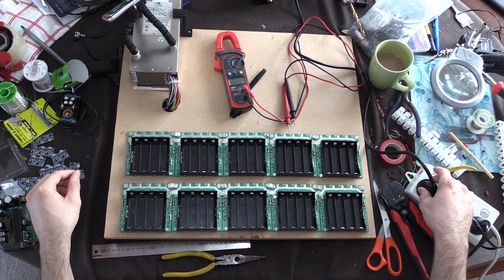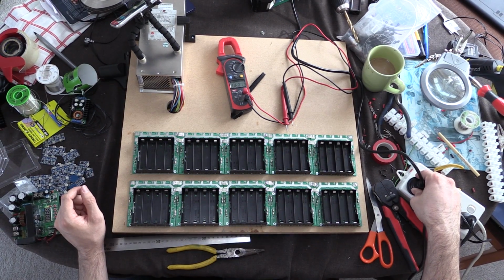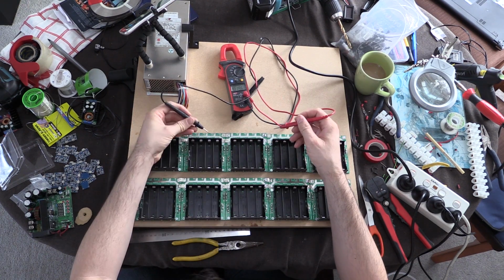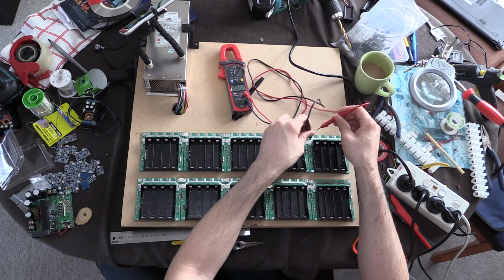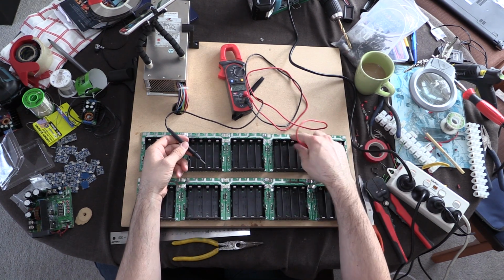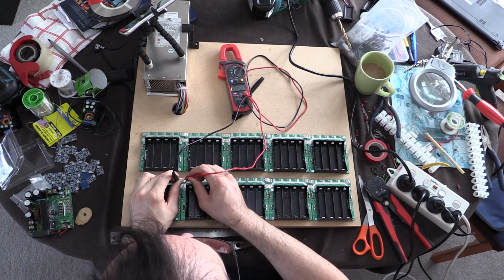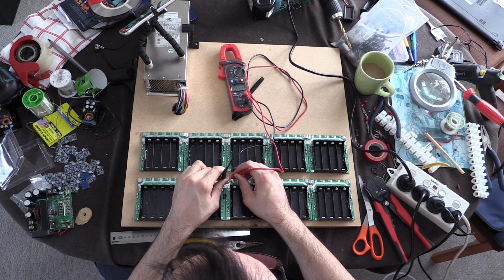So I've just connected this on, moment of truth, because that way the camera's on if anything blows up. So let's turn that on. Okay, so far so good. Bit of hum. Okay, so now we'll test out our 5.2. Come over to here. That's nothing. That's good, because this is going to be connected to our buck converter. So these 8 cells aren't connected to the main power supply right now. So 5.2. 5.27, that's good. 5.27.